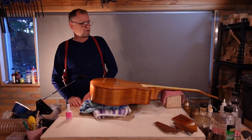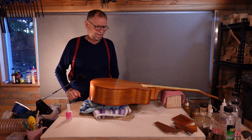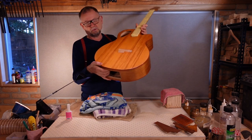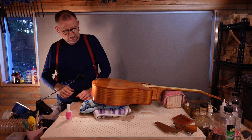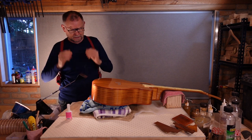Before we get stuck into a fresh new day's French polishing, remember the crack in the back. I realize now I should have worked some Titebond into the crack as well as the stepped fixer blocks, which you won't be able to see. But my idea was to drizzle some CA glue into the crack later on, so let's try that now and see what it does.